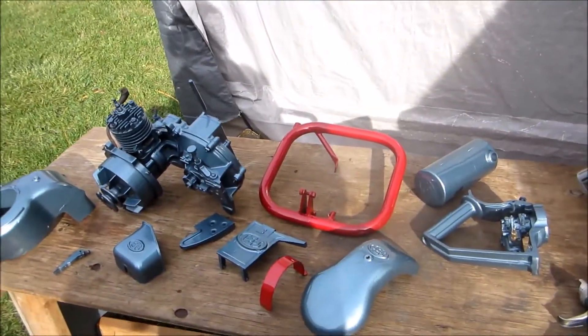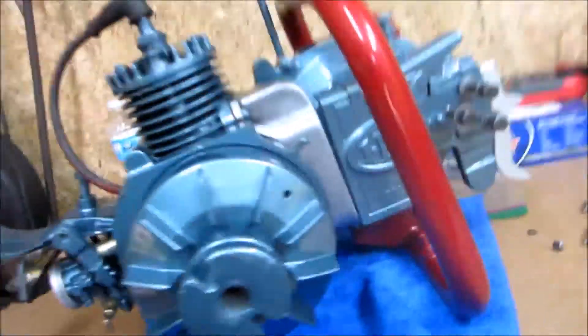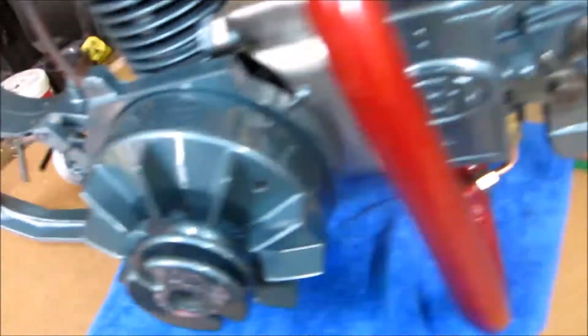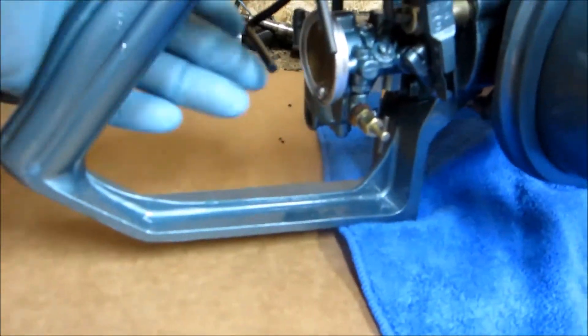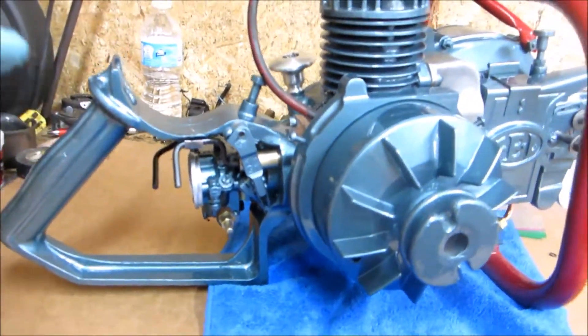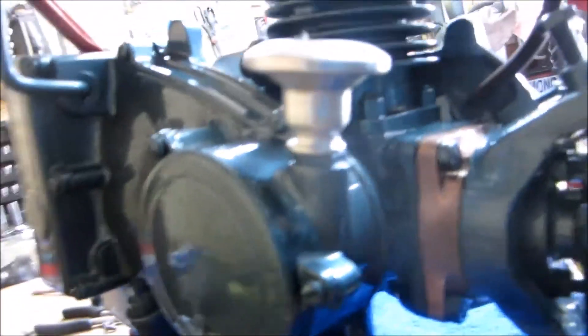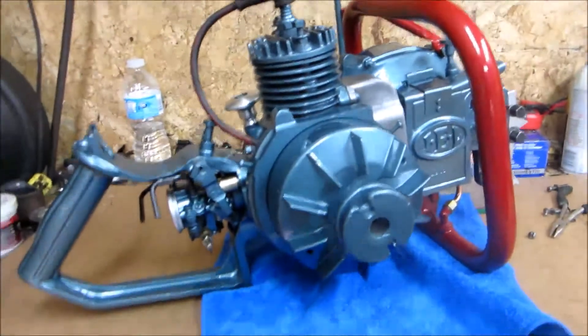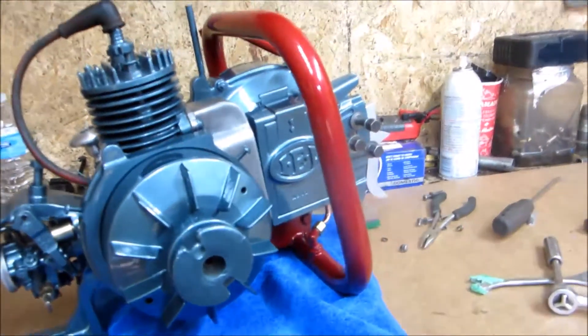Just back quick — I've got the front handlebar on. This front handlebar is an actual oil tank for your bar oil. Got a coupler there, got the cover on, got the front spike on. Got the rear handle on. The carburetor is your throttle linkage — that's when you pull to rotate the handle. Because it's a float bowl carb, you tip the saw and keep the handle and fuel tank upright. There's a brand new — sorry for the shaky camera — brand new aluminum handle, that's what they had.